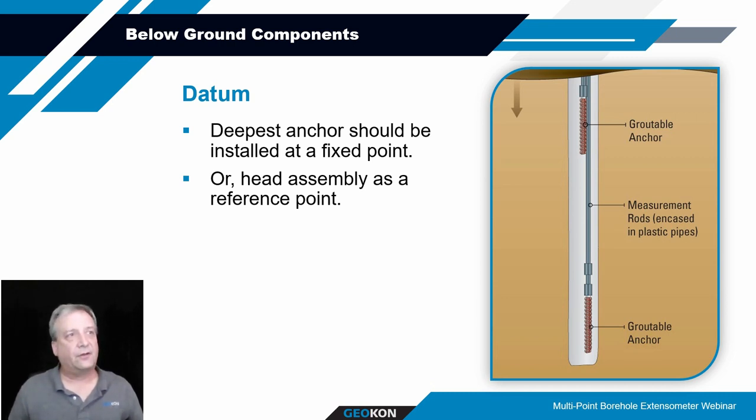If your application doesn't allow for that deepest anchor to be your point of fixity, such as a tunnel, where you're installing your MPBX over a tunnel alignment, then you'll have to rely on the head assembly itself as your datum point, your reference point. And in doing that, ideally, it's best to have a level survey performed on your installation periodically, just to verify where the absolute position of that head is,